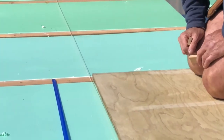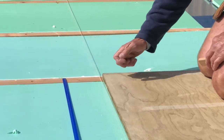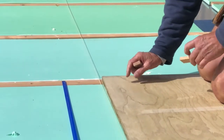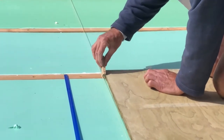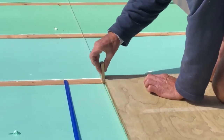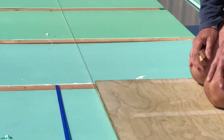Here I am at the other end of the plywood and the line is being offset by the dodger block. It's a little bit challenging today because it's windy, so we've got to make sure the wind is not blowing the line. With another block, we simply put it in there and test that it's just brushing the line — it's not pushing it out, there's no gap there — and that's perfectly aligned.